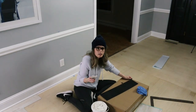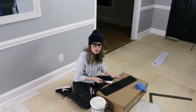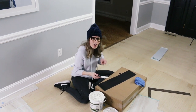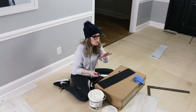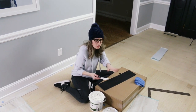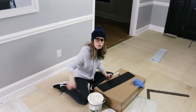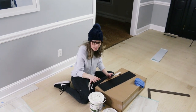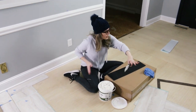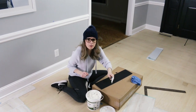You don't have to take this extra step, but I'm applying some adhesive to the back of the peel and stick tiles. There's enough adhesive on the peel and stick itself, but since the foyer is a high traffic area, I want to be sure everything stays on the floor and not moving. We've also decided instead of doing all of the border first, we're going to do everything in sections — starting at the very beginning of the foyer, working our way down to the door, adding the border and the rest of the tiles at the same time.